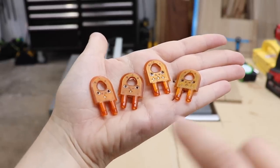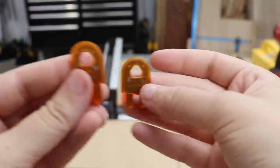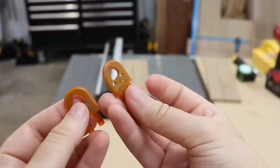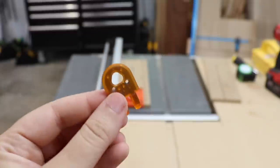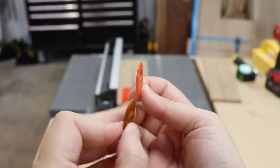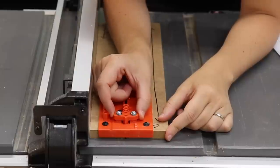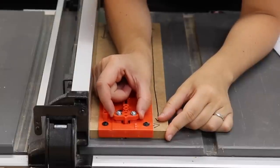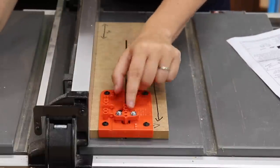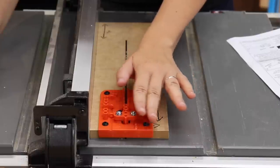Now you have to make a decision — there are two ways to set up the splitter. The first is a double splitter, where one splitter is in front of the other, which is great for dimensionally stable stock like plywood and sheet goods. The other is a splitter kerf keeper combo, which is great for hardwoods because it can prevent kickback when there's tension in your boards by lifting out the kerf keeper if tension occurs. Depending on which setup is right for you, that's where you'll lock down the drill guide. I'm going with the kerf keeper, so I push the drill guide in towards the fence and lock it down.